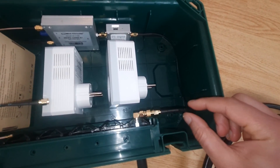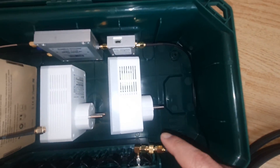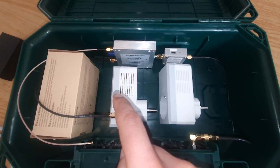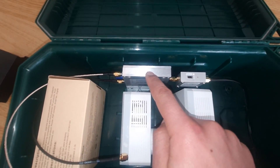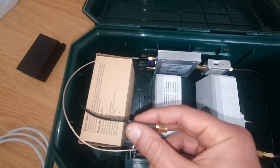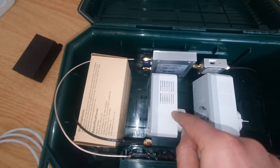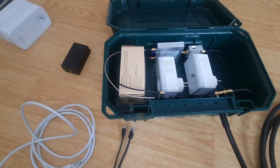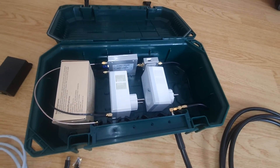Always use minimum cable for less dB loss. Inside the box I need to organize the cable, DC injector, and three-way splitter to help fit the miners. Option one is IPX to SMA male; the easier option is RPSMA to SMA male. Now you'll ask me: how do you power your miners and your amplifier?